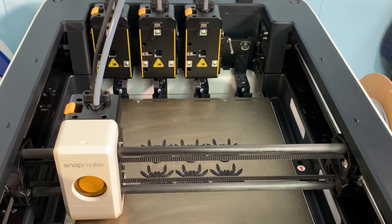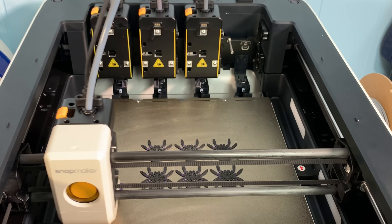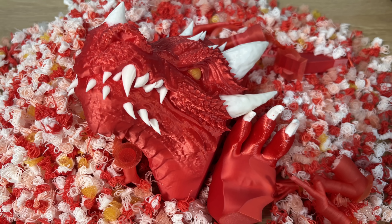The Snapmaker needs about 12 seconds to change colors, and that includes the time it needs to heat up and wipe the nozzle off on the purge tower. A Bambu Lab running the older AMS — like most of us have on our X or P series machines — can take around 90 seconds to swap colors. It needs to bump the tool head against that prong to cut the filament, then park while it reels the filament back into the AMS. Then it pushes new filament out and uses a fresh color to clean out the nozzle. Sometimes this takes a lot of purge, especially if you have a light or translucent color. The time to swap colors doesn't seem like a lot, but it really adds up because the printer has to do this every time you ask it to change colors.